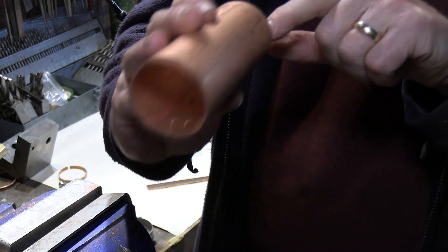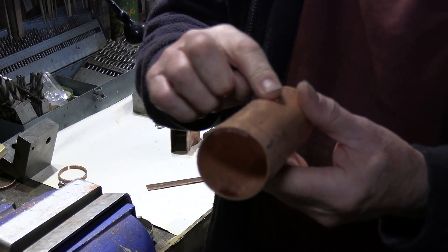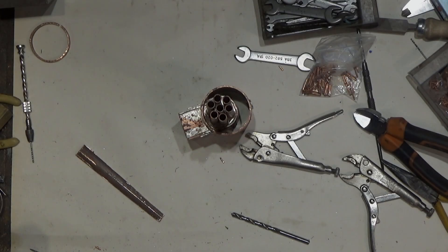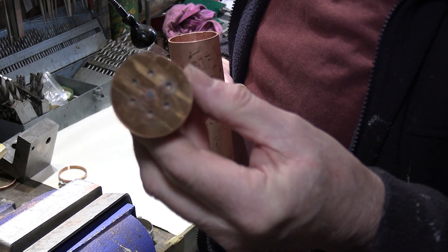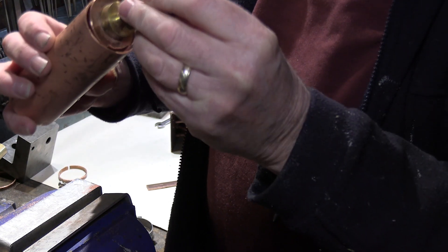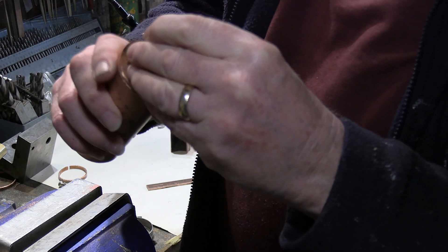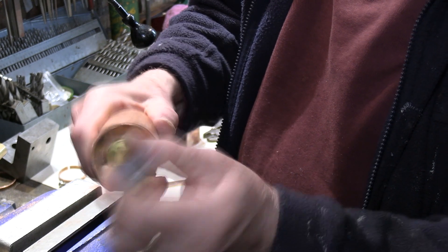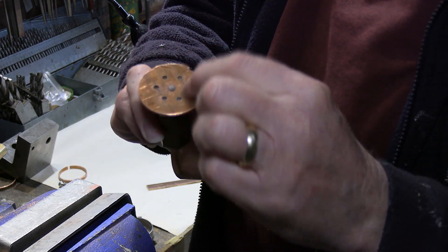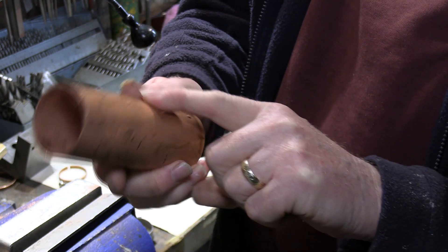This is a two-stage silver solder — I'll be silver soldering on the inside first, and then I will silver solder on the outside. I've also done a little bit of work on the front boiler tube plate. Using this almost like a plug guide, it now just fits in — it's a nice fit into there. So what I'll be doing is taking this off the solder base and drilling the holes for the boiler tubes, but the next thing is to silver solder this up on both sides.